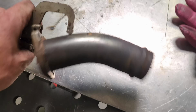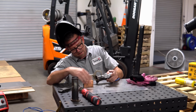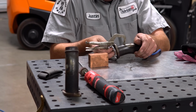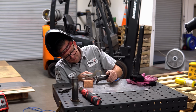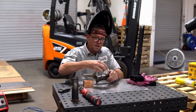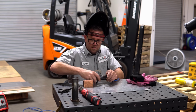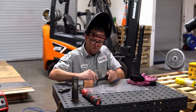So we're pumping about 5 or 10 CFH of argon here, and it's because I have a pretty big opening in the back here, which we're just gonna stuff with a foil ball. And with any luck, this will help prevent some of that really heavy oxidation. I might not have grabbed enough foil. Put some of that there. Oh, come on.